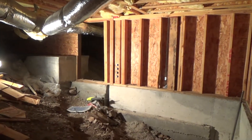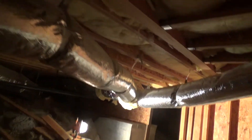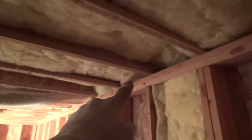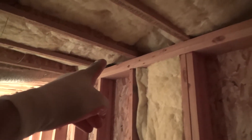What is our project today? I'm still doing some work underneath the house. This whole section of floor up above is all supported by this big huge beam right here that goes straight across, because these TGIs go beyond here — they cantilever out to make a bay window in the bedroom, and it sticks out over this wall maybe four feet or so.